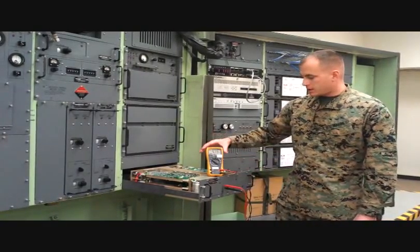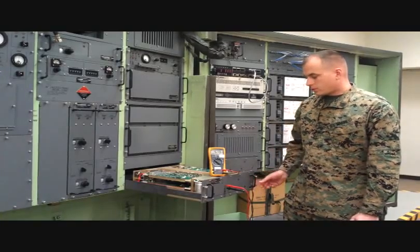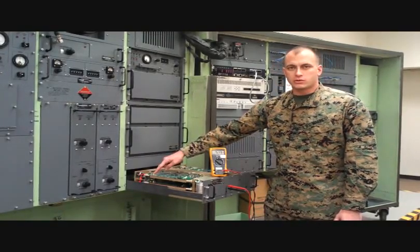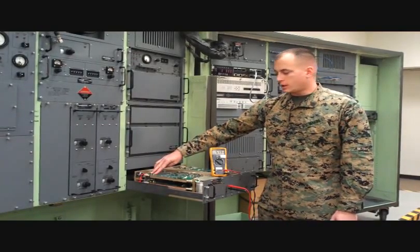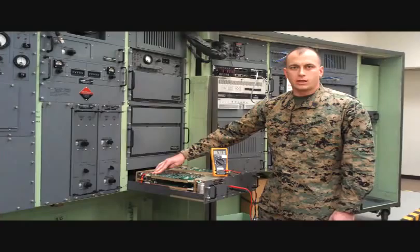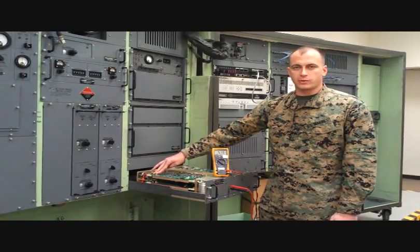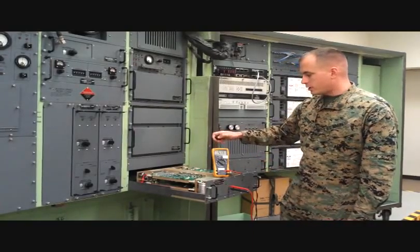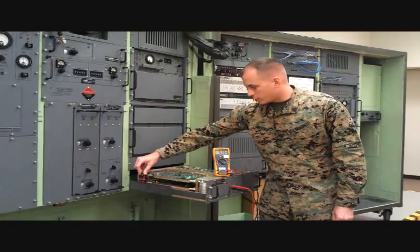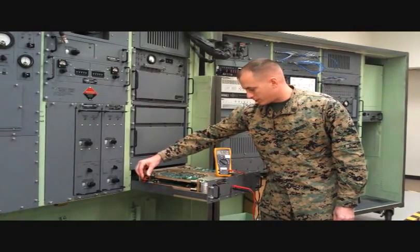Using our test scenario set up today, we're outputting a voltage of 5.13 volts, which is slightly out of tolerance. So if you have a card that's out of tolerance, what you're going to do is find R20 on the card. R20 is located in the same general area on all the CCAs, between a red and a green LED. You're going to adjust R20 to get that card within 1% of its rated output. For example, on a 5.3 volt CCA, you're going to be looking to get it in the range of 5.25 to 5.35 volts. Using a jeweler's screwdriver or a small alignment tool, adjust that resistor in the correct direction to either raise or lower the voltage to get it within that 1% tolerance.